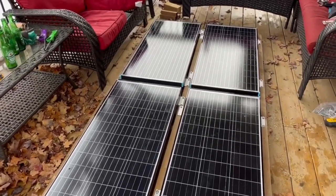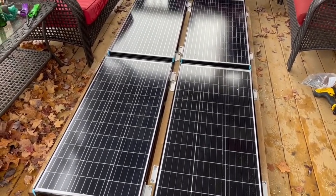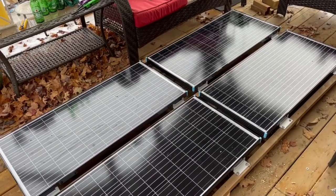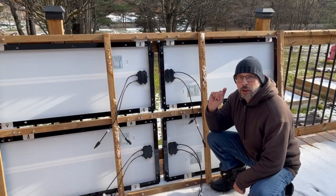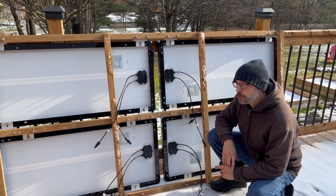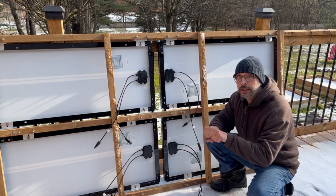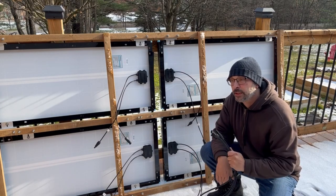I really love how you can offset the center mounting brackets so the panels line up perfectly. I'll need to rig up a mounting system for the stakes coming out of the ground once we arrive at the property. From the back side, it's very important that when you're mounting these you have the orientation of the connectors all to the center — it makes it very easy to make your final connections.